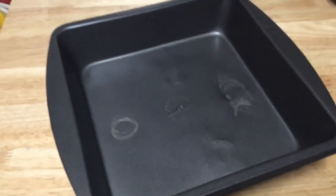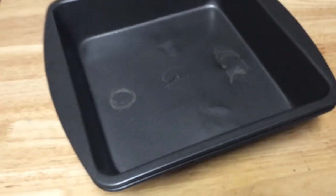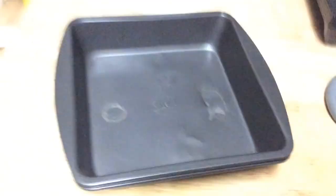Now that the plate looks pretty uniform, put the pan back on top. You can clamp it down, keep compressing it, or put a heavy object on top to keep it flattened as it's cooling. Let it cool for probably half an hour or maybe even more — it can stay pretty hot.